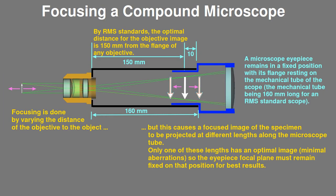However, for modern microscopes the situation is different. In a microscope, the eyepiece is placed at a constant fixed optical distance from the objective by means of a fixed length of tubing on which the eyepiece rests, and focusing is done by changing the distance between the object and the objective. Microscope objectives can make a focused image of the object appear at a wide range of positions, but the image will be optimally corrected for aberrations only at the optical path length of the objective which, by RMS standard, is 150mm from the flange of the objective, or at infinity for infinity corrected objectives.